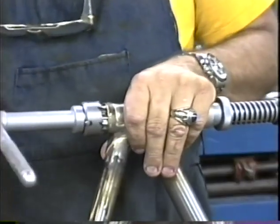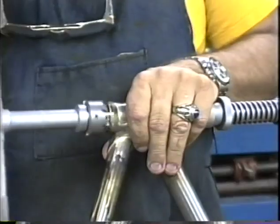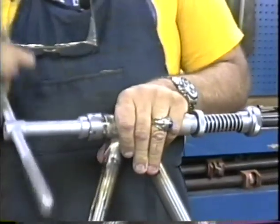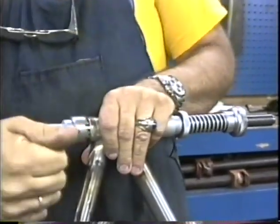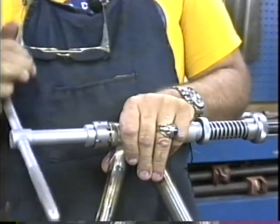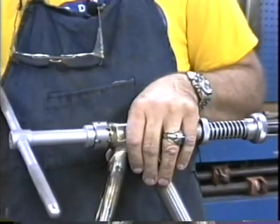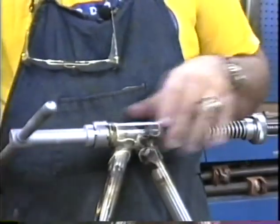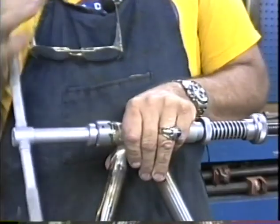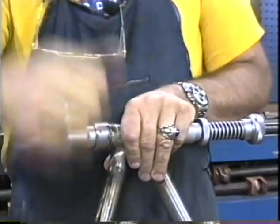Some people will tell you can only go a certain speed with these cutters. I heard one person say you can only go 18 RPM with these cutters. I have no idea where they came up with that number. These are high-speed steel cutters. They're made for cutting chromoly steel. They'll cut mild steel, they'll cut chromoly and anything less. And the cutting speed of steel ranges from 80 to 100 feet a minute. And if you compute that, this cutter can probably be turned over 300 RPM without risking any damage to the cutter.